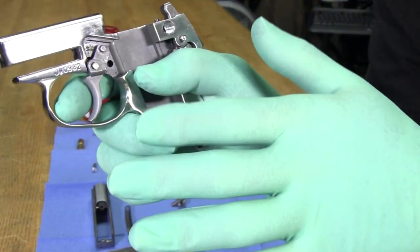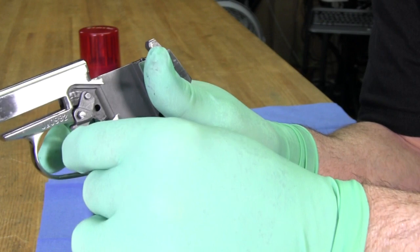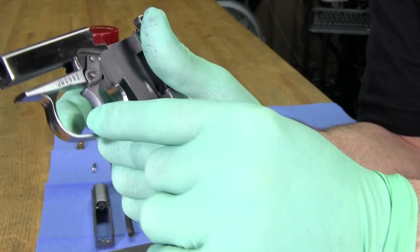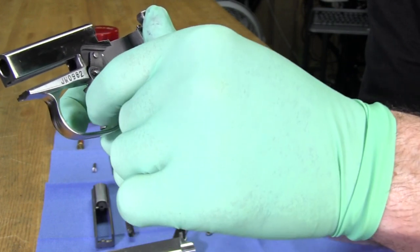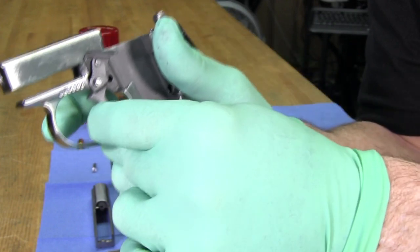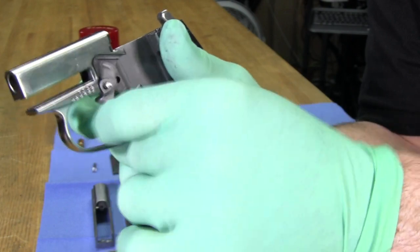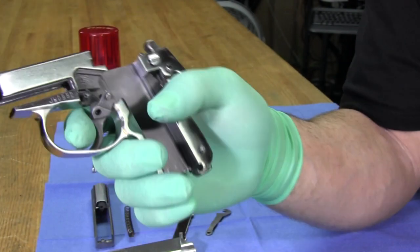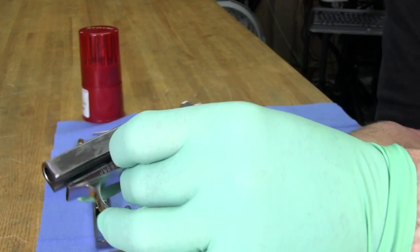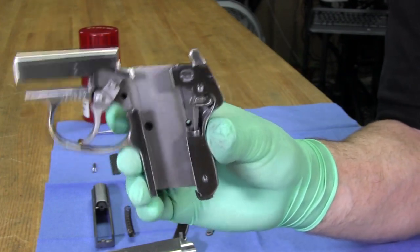Sometimes it didn't do that, and I can only think that as I pulled the trigger on those occasions I was actually applying a slight lifting motion on the trigger itself — that kept it just enough clear. It was only a few thousandths I needed to file off to clear it, so it wasn't very much. I think there's enough movement in this pin-to-trigger connection that it actually rode up as I pulled it, fired, and then came back and cleared. As you saw at the beginning of this video, before and after — now it just shoots reliably: bang, bang, bang, no problems anymore.